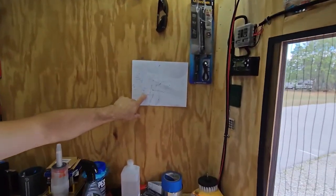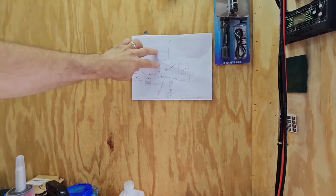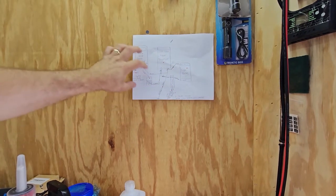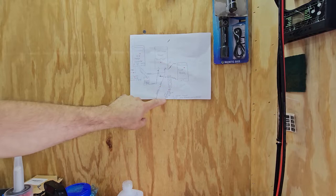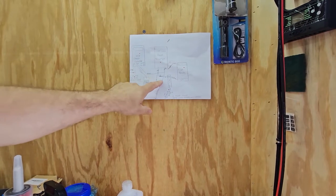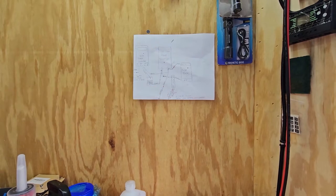Here's my crude drawing of the solar setup. We're going to have our 40-amp charge controller, a 1100-watt power inverter, a fuse block, a 50-amp circuit breaker in-line to protect everything, and a surge protector or fuse on the positive side of the battery cable. For cabling, I have it marked: 10-gauge coming from the panels, 6-gauge, 4-gauge, and 2-gauge for each leg of the system.